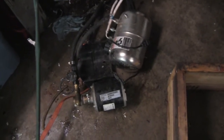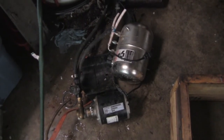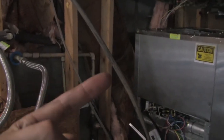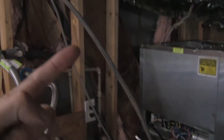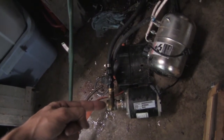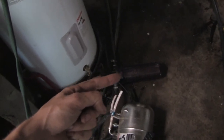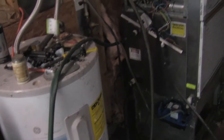So what you'll see down here on the floor is a carbonator pump, which takes water from the creek next to my house, in a pit that I dug with a backhoe and put a 5-gallon bucket with holes drilled in it. It brings it in through this black 3/4 inch HDPE pipe right here. Comes in along there and all the way, whoa, my finger's off shot there. It comes down into the inlet through this strainer, and then there's a little strainer in the actual pump. Then it comes out through this much larger sediment filter because I don't want any gunk from the creek clogging up my heat exchanger. So from there it follows this garden hose out and just drains down my driveway because it's just water from the creek. So it shouldn't really be contaminated with anything.